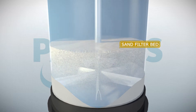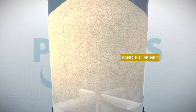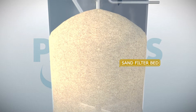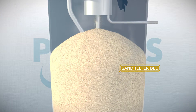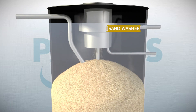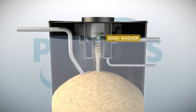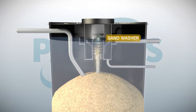The second section is the sand filter bed. During the sand filtration process, the filter bed is cleaned continuously. Interruptions are eliminated through this continuous self-cleaning process. The last section is the sand washer system. In this system, final traces of pollutants are washed out with a small amount of filtrate.